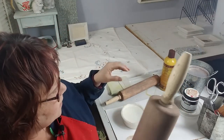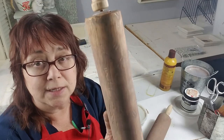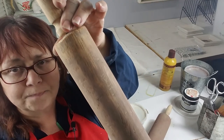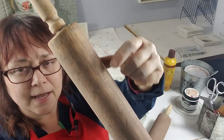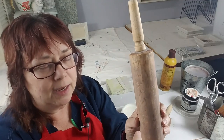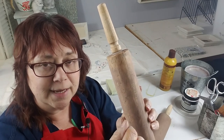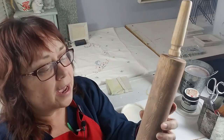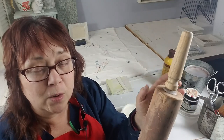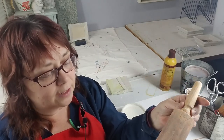I'm going to wipe this down now. I have another one here that had a heavy polyurethane seal — it gave me a lot of trouble. In the places where I distressed it, it didn't get darker; it stayed light. I think what happened is I did the distressing before I sanded, so the coating was still there and the sanding didn't get down into those distressed areas. Tip: always sand first, then distress, and you'll get a more even look.